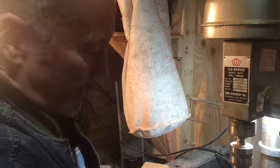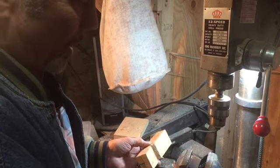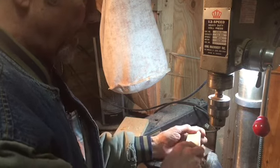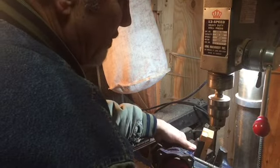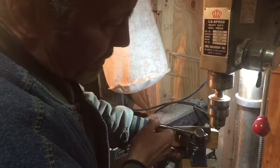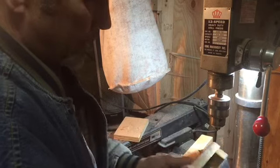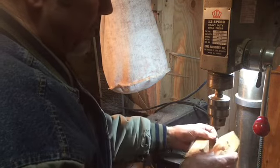First thing I'm going to show you is how to make a pen blank holder for your vise. You'll notice that it's offset so that it doesn't hit the center, doesn't hit this piece here when you are drilling. I glued it and just tacked it in there with a little brad nailer, but this actually fits over that. I also made a piece for the bottom of the vise — it sits on the bottom right there so that it stays on there, and I've also got the piece for the other side. So it's just little blocks, very simple. Cut out the V and do that on your bandsaw.